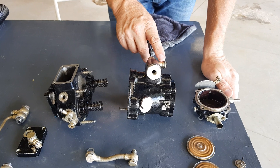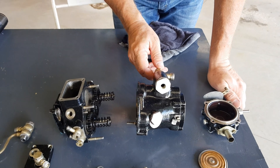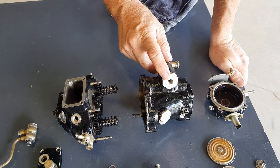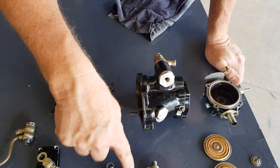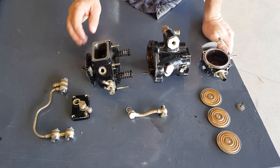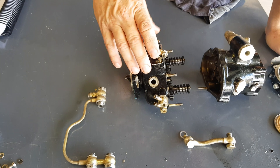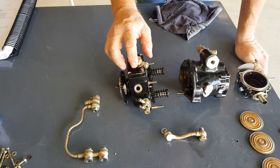The fuel comes in here inside. There is a pressure valve adjustment with the filters. And this here is the fuel pump — it's a blade pump, which delivers the fuel to the engine. From here, it cuts through this pipe inside the aeration housing, which separates the fuel from the gas. The gas returns through this here to the fuel tank and also measures the fuel pressure.